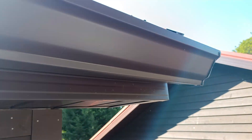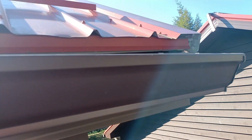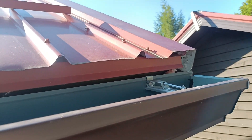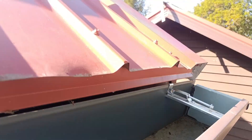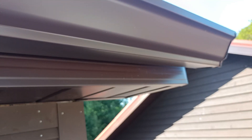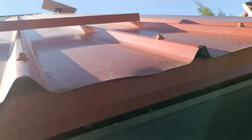Here's the house, or at least the corner of the house. The customer said somebody saw three bats coming out of here. I sealed up the corner — I know they're not coming out of that corner right there, that's closed. I don't really see any poo in the gutter, just some tree debris. I decided to look really close here and when I check up here I stick my fingers under the drip edge and I feel material. That's a good sign — there's something there.